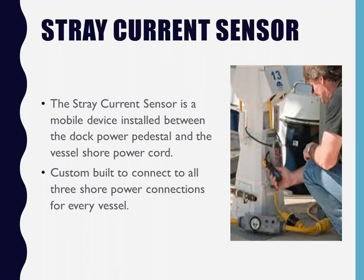So I jumped in a plane, I flew up there, and I said, this is what I want. I want to change the circuitry in this thing where it activates an audio and visual alarm only. I need a circuit board and an audio to go with it, which I have, and I actually pot the circuit board myself. I also want to pot the inductive pickup winding inside of the ground fault sensing module to get rid of the RF problem. And I also want you guys to delay the trip time. I want it to give it another millisecond for older appliances to power up to get rid of this nuisance tripping, because every time I get on an older steel houseboat or whatever.